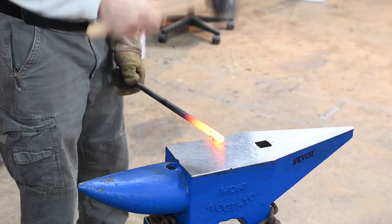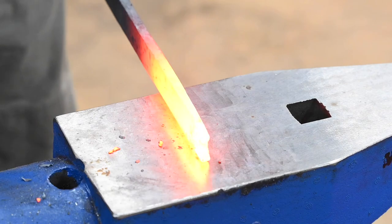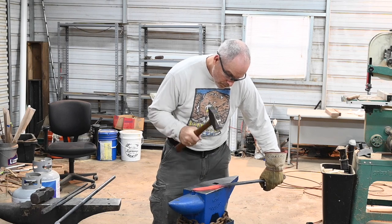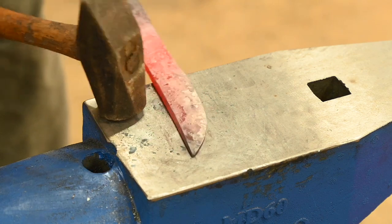And that's it. The triangular base will sit on any surface, no matter how uneven. Now, if you're going to be putting it on dirt, you'll want to weld some flat plates or some kind of little feet on the bottom so that it doesn't sink down into the dirt. But for me, using this completely on a concrete floor, it's perfect as is. The main thing — this stand is totally solid. It doesn't rock or flex or do anything to eat the energy of your hammer. That's the single most important thing about any anvil stand: it's got to efficiently contain the energy of your hammer. And this does that in spades.